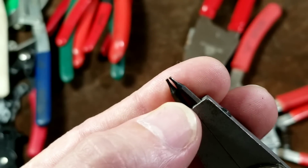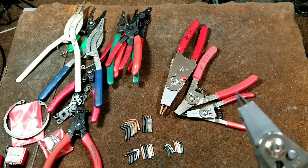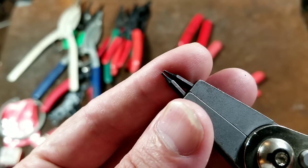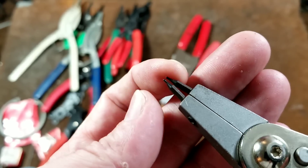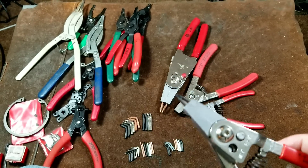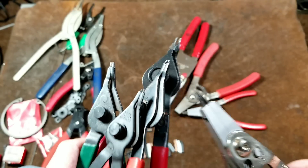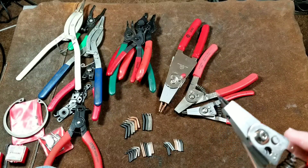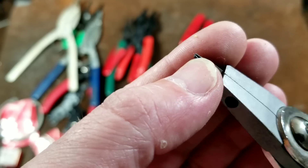The tips on these are held in via a hex so that you can align some of the more bent ones closely. On straight ones, it's really advantageous because with snap ring pliers, the tips wear out pretty quickly. Snap rings are always made out of very hard steel, so inevitably when they slip or just through normal use, the tips start to round and then they want to slip, and then you have to get new snap ring pliers. That would be the second reason I'd recommend them over sets like this style — because even though this style is convenient and does reach in tighter spaces, when these wear out and start slipping on the snap rings, you either have to get them warranted or just buy another pair.